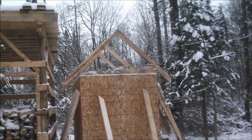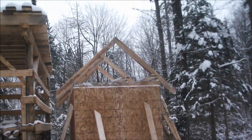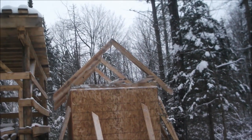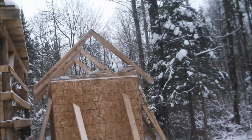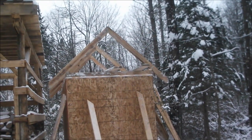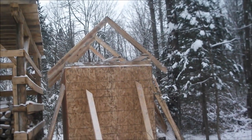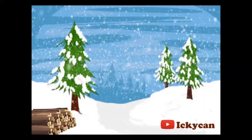That's six up, and I think that's it for the amateur gymnastics today. I have a ridge board that goes down the center yet — I'll just be pushing the rafters apart and lifting it up, and they actually hold the ridge in place while I nail it. And of course fascia boards after that. I know it doesn't look like much but that was a lot of up and down. Who needs the gym — boy am I out of shape. Anyway, it's the journey not the destination. I'll bring you back tomorrow.